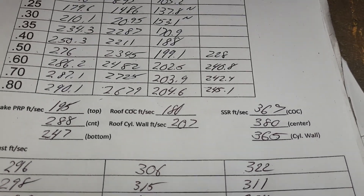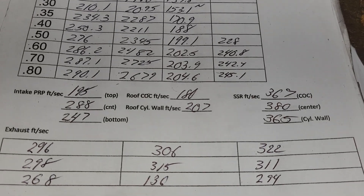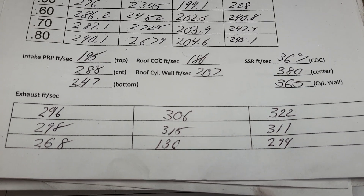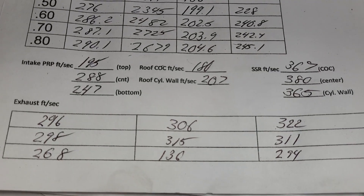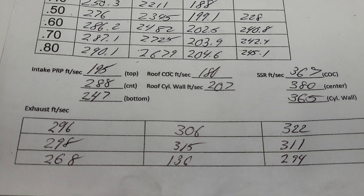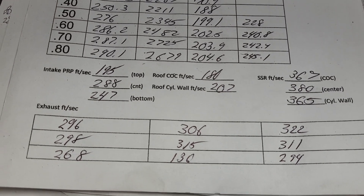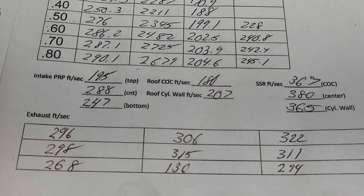As far as our air speeds on the intake, they look good. I'm going to do the flag demo and the flow ball demo in this video. As far as the exhaust speeds right now, we're good almost all the way around except the floor. On the left we got 268. You'll see the flag flutter a little bit more around that area and the floor. Everything else should be the same, and you should be able to see the angle of the flag turning to the lower pressure.